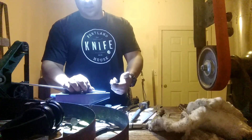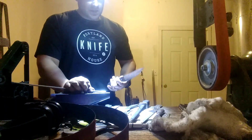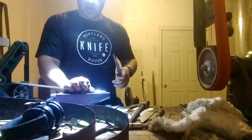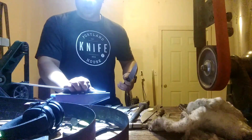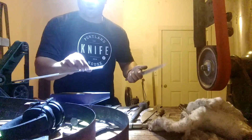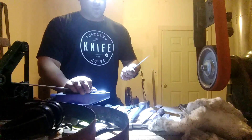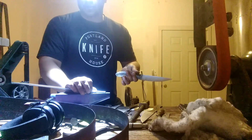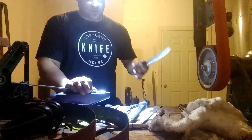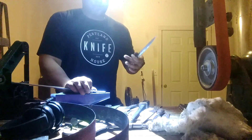I want to show the limits of geometry for 8670 — you can't get it thinner than nine thousandths. If I want to push this geometry further I'm going to have to look for a different steel. The geometry I'm going to choose is about 15 thousandths, meeting it halfway. I'm not designing a knife to be a good cold chisel — I'm designing a knife that's going to cut well, and these will hold up for regular cutting in the right person's hands.